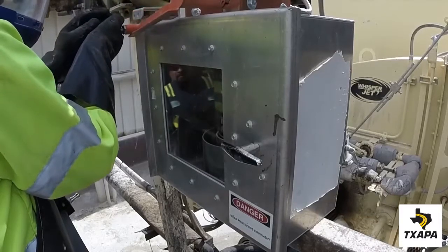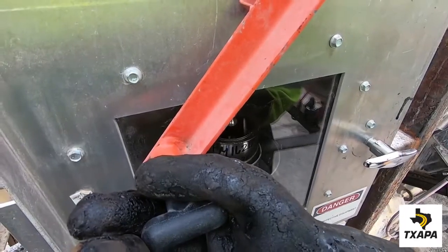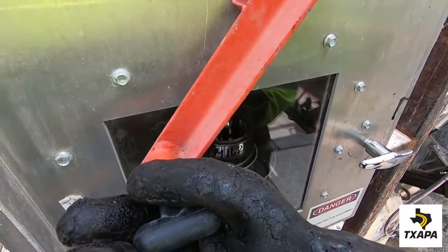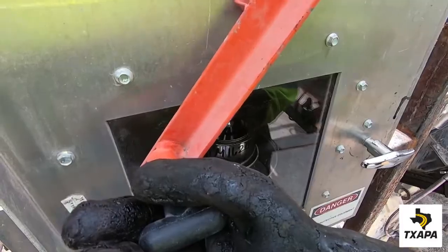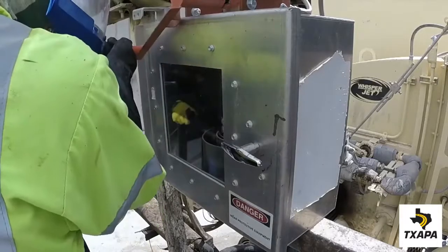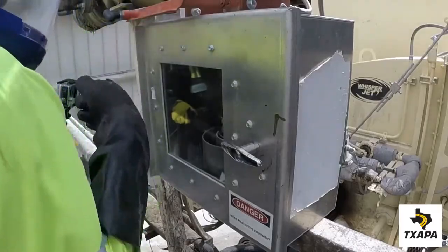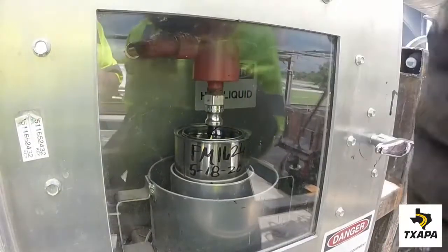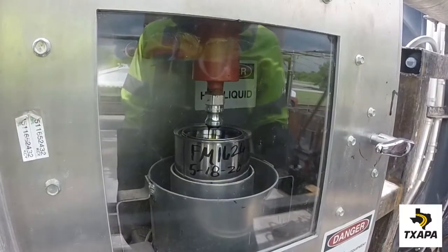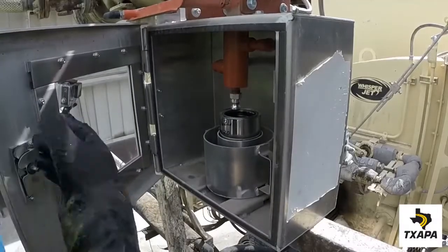Notice that it covers the door while it's filling the can. As the bar is lowered, the material flows from the in-line heated line into the sample can. Once the can is full, close the lever and re-latch to complete. Allow the material to drain into the can, and then remove the can. Cover and seal tightly.